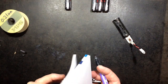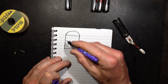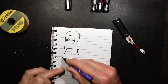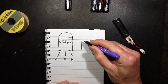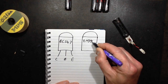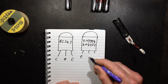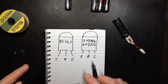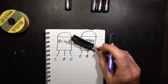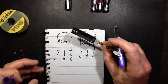For transistors — if you're using a BC547, this is what the connections look like from the front printed side: collector, base, and emitter. If you're using the more popular American ones, the 2N3904 or the 2N2222 — I think they're both the same — the leads will be emitter, base, collector. The base is still in the middle but they've swapped emitter and collector around. It's worth noting that the circuit is pretty indestructible — if you get the coil mixed up or the transistor the wrong way round, you can usually just pull it out and swap things until it works. It just takes a bit of experimentation.